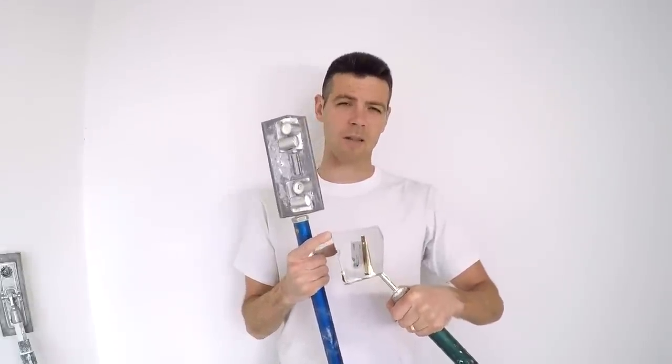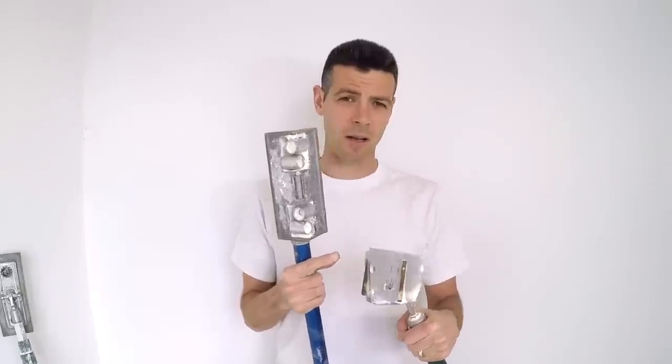Corner tools — if you're doing any reasonable amount of drywall, corner tools are a fantastic investment. They cut my time down so much. They're the one tool I wouldn't do drywall without. As you can see, the finished product looks really nice. I've always been happy with it, even though it's only about three inches. You can do it by hand and it can be like five inches out by knife, but I find this is adequate under almost every circumstance. And the tool that really makes it is this corner roller — without the corner roller, it's not going to be as square and as straight. This is essential in the kit. Anyway, that's how I like to do my corners. If you're looking for any of these tools, I'll put the link in the description below. Thanks for watching Vancouver Carpenter — if you want to support the channel, do all those like and subscribe things. I hope this sheds a little light into how these tools get used. If you use them differently, let me know in the comments. Thanks for watching, until the next video.